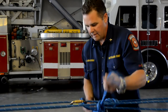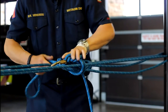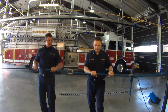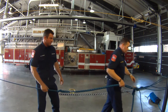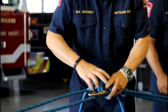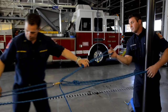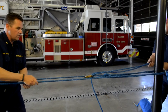I don't need to untie anything because we're going to have to reset this system in a minute. So let's go ahead and loosen the rope up. Now we've done a couple rescues, the rope is loosened up. One of the nice things about this is we don't have to take the entire system apart to reset it. We just undo that safety and pull tension again — one, two, three, pull — and we've retensioned the system without having to reset it.